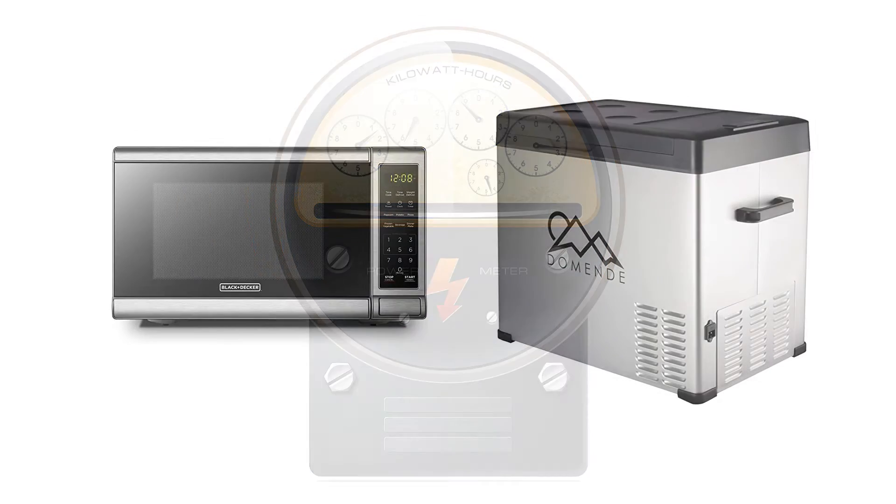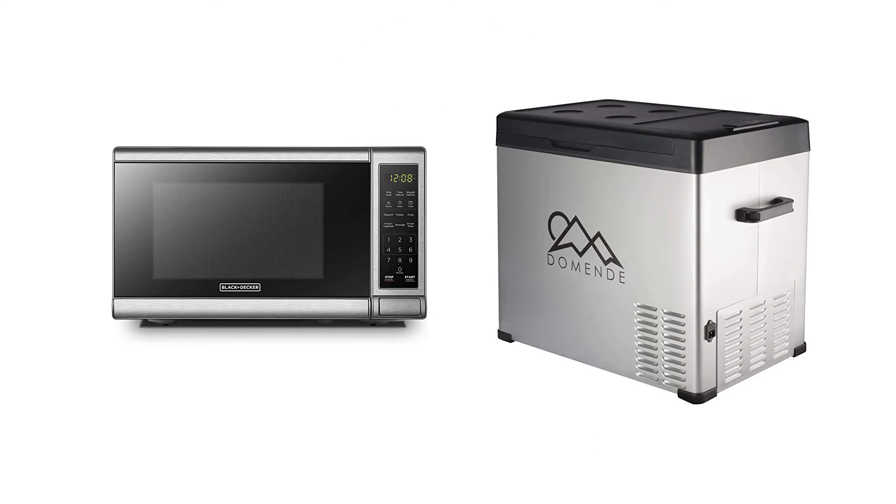For example, I have a microwave and refrigerator that will sometimes be running at the same time, so I need to add together the wattages to figure out how much power they will use when they are both running. My refrigerator only draws 66 watts, but I have a microwave that is advertised as a 700 watt microwave. Unfortunately, when I hooked up the microwave to my 1000 watt inverter, it kept overloading the inverter and causing it to turn off.